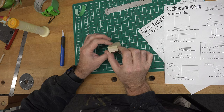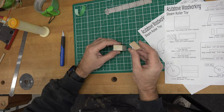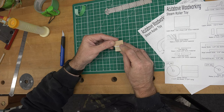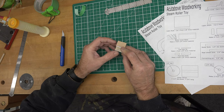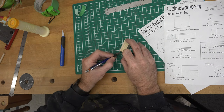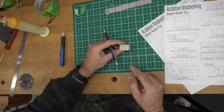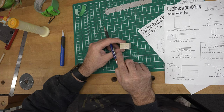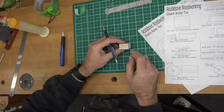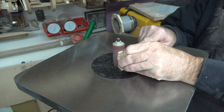I have a piece of three quarter inch thick material that's one and an eighth wide and one and seven eighths of an inch long. Line up the template with the side of your piece and trace that profile onto the pre-cut block of wood. You can cut this at the scroll saw or band saw, but I'm just going to take it to my oscillating drum sander and sand it away until it matches the profile I want.